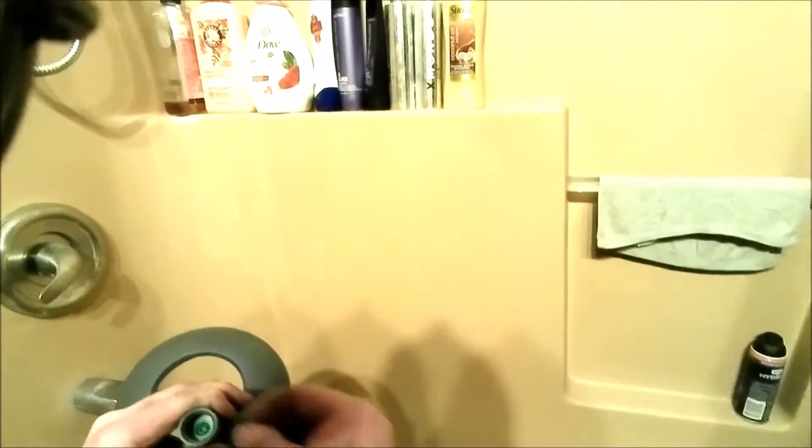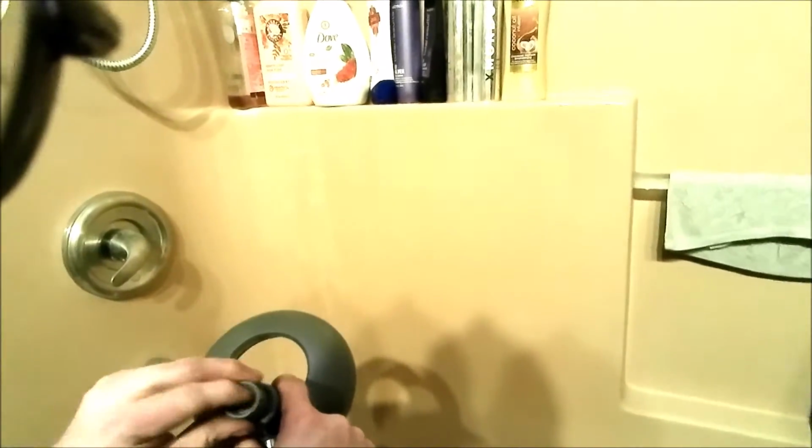And to get this off, I'm looking for the water restrictor, which is usually hidden behind here, but I don't see any restrictor, but we're going to pull this out. Oh yeah, okay. So hopefully you can see in there. See that little gasket that's way down in there? So you want to grab that and pull that out. Now if you live in California somewhere where they restrict water, you have to leave that in. But if you live anywhere else, you can get away with pulling that little water restrictor out. And then you're good to go. Alright, okay, so I'll put that down there for now.